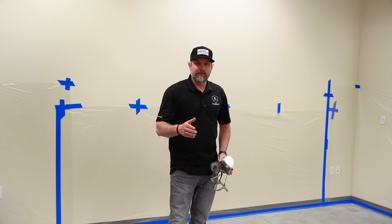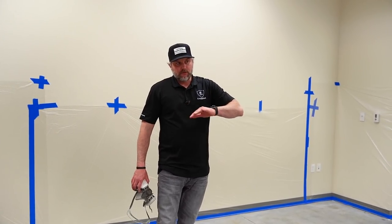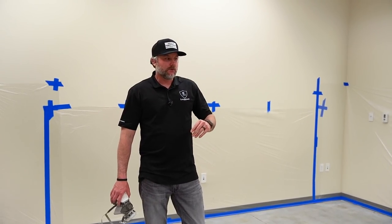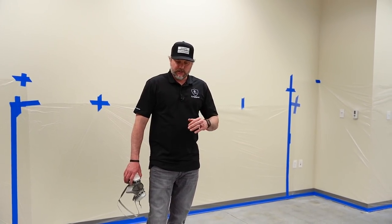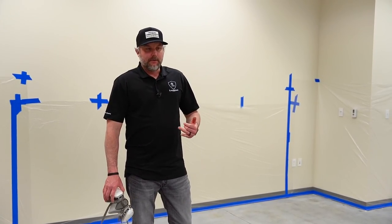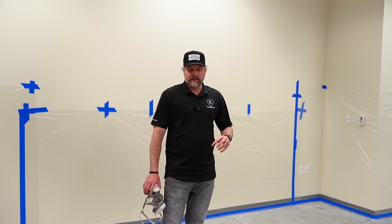That way when we put our tape lines for the grout lines for the wood grain, we have black grout lines without having to do a full coat of overlay in black. So it saves a lot of time, it's fast, the stain dries quick. We tested a few spots to make sure this would work. It will pull up a little bit of the stain just because it's pulling up some of the loose micro aggregate that's in the cement, but it still looks black. So that's what we're doing. We're staining this black to create black grout lines in the overlay.